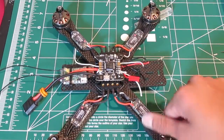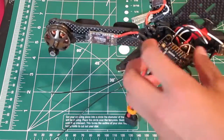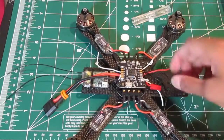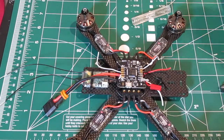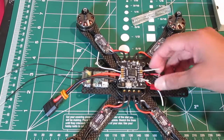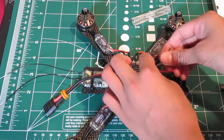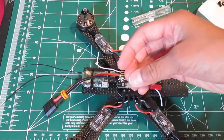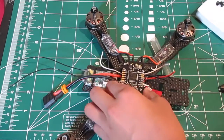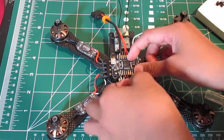I apparently stripped one of these wires off, so I had to take the screws off to solder it back on. If you do that, it's a bit easier to put the wires together and solder them. You can put the screws on later on in the build. Now I'm going to continue trimming these wires.